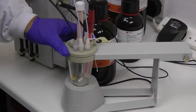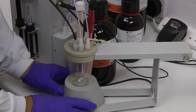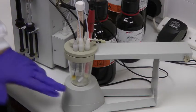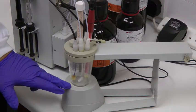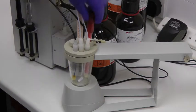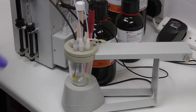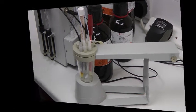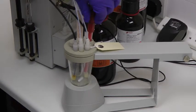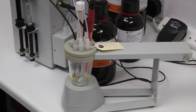The working part of the system is the titration vessel, which sits upon a magnetic stirrer. The positioning of the stirrer bar is very important — it must be able to move freely once the tubing and double platinum electrode are in place. Setting up the titration vessel is very simple; all of the components fit into recessed holes, and the vessel itself clips into the bottom to provide a firm fit.